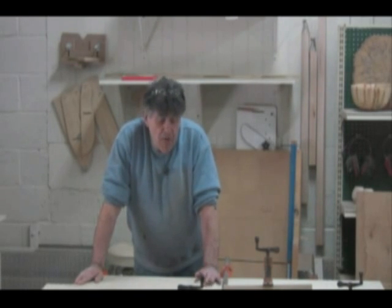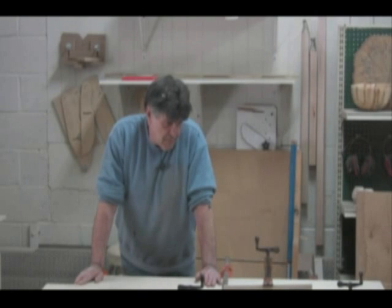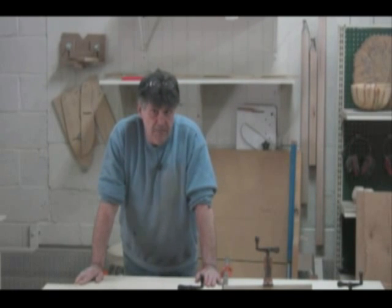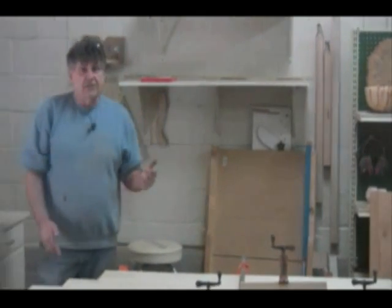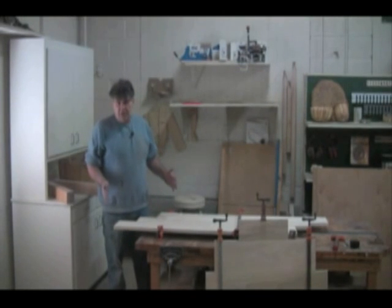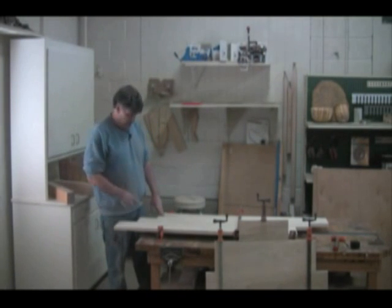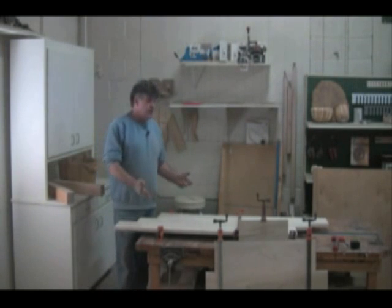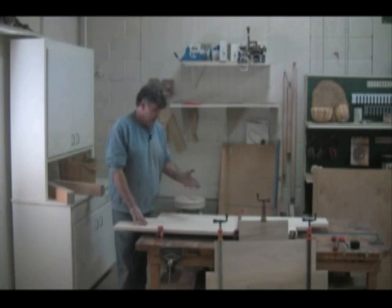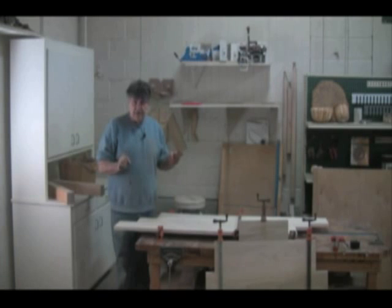The other thing that I do is I always glue up thick. Now, I'm fortunate enough in the back, I've got a 20-inch planer and a 22-44 drum sander, so I can put these shelves through after they're glued up and sand them dead flat. But I would imagine most of you guys don't have that. So here's the trick I used before I got all of that stuff, because all I had was a little lunchbox planer. These are only 20 inches wide. I would glue them up just like you see. Then I would go back to the table saw and rip it right in half. In this case, these shelves are going to be painted, so to have that extra glue seam in there isn't going to hurt a thing. I would glue them up thick, rip them, and then take them back through my planer, then plane them all to dimension, to the exact thickness I want.